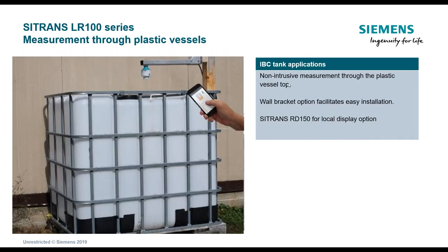One of the potential advantages of this technology is that it can shoot through plastic vessels. Here is an image showing the transmitter mounted above a tote, where the customer wants to validate the level of product in the tote without penetrating the top. There may not be a process connection available to install the transmitter directly, so this external mounting approach is a key advantage of this technology.